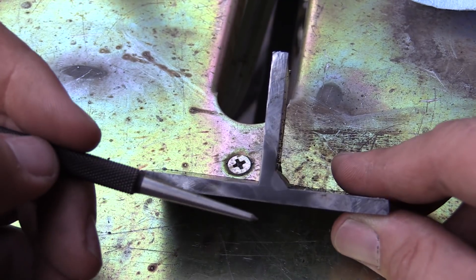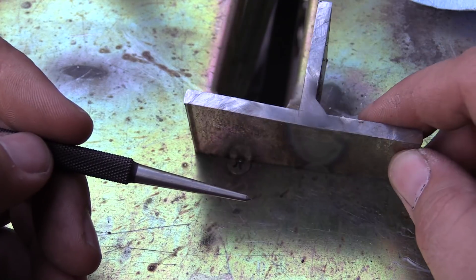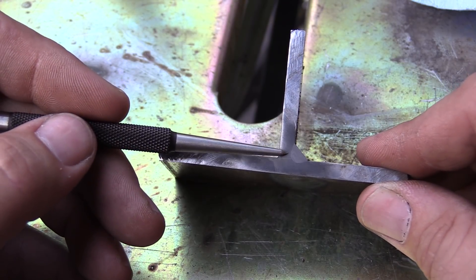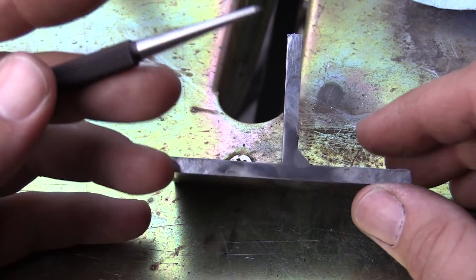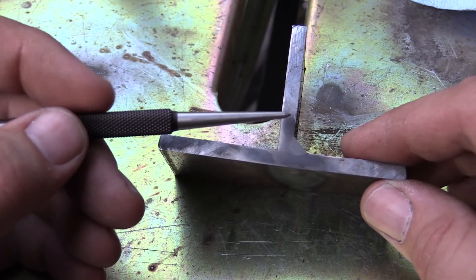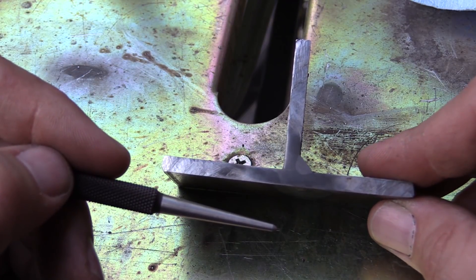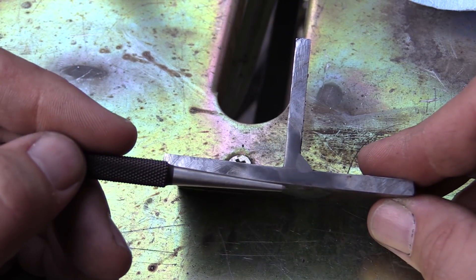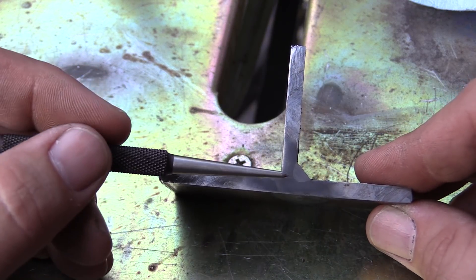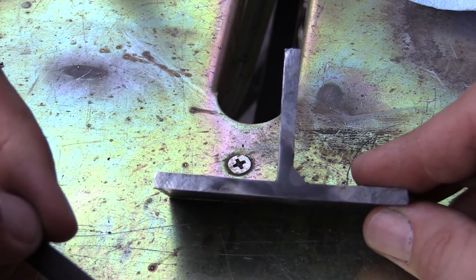This is just a small little sample, so the part heats up quick and it's easy to get good penetration on something like this versus some big large item with a lot of metal that's really going to suck the heat out. But even still, I'm pretty impressed with that for just a little 120-volt, 88-amp rated welder. It does say it'll do more than that for short periods, but yeah — 3/16 material, fairly decent penetration.